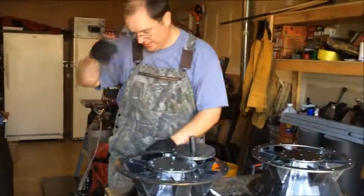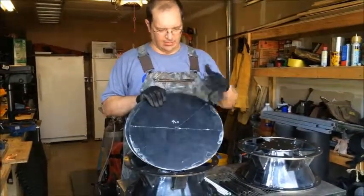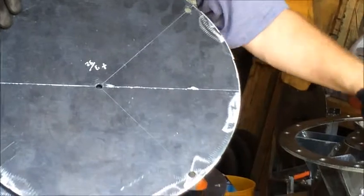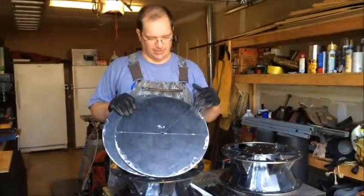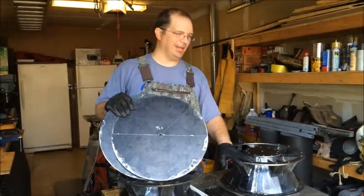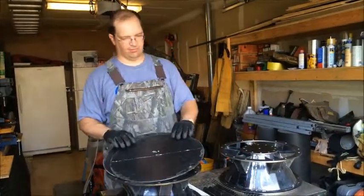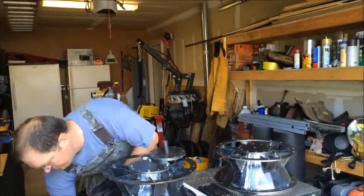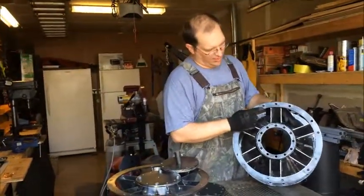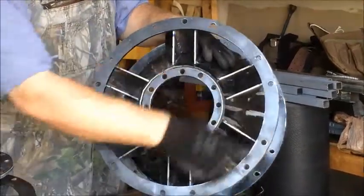When I put all this together, I made up some jigs. You can see holes are pre-drilled in them for standoffs that go in between these plates. The bad thing about staying so true to the German design is that the Germans had a very odd bolt pattern on these sprockets — it is not symmetrical. Most of them are consistent, but you have a pattern where most are groups of two, except for this one, which is just three. So the distance from here to here is different than the distance from here to here.